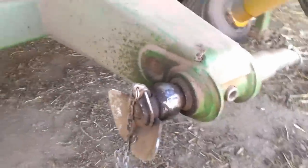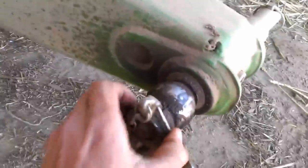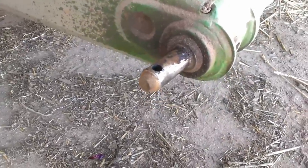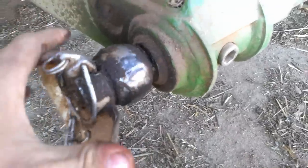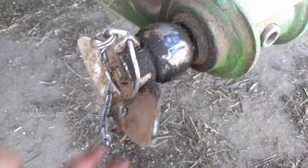So these are the balls that go into the quick hitch couplings. That's just your standard Cat 2 linkage pin. That slips over and pins on. You can get just a ball without the wings, depends what you're putting it on. The wings make it a little bit easier to hook up because the hook sort of guides it in.